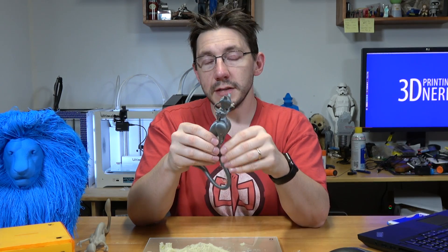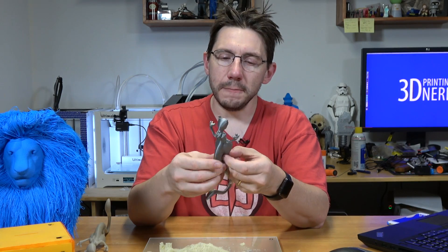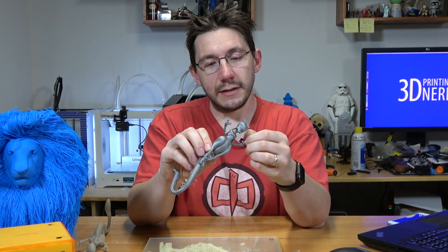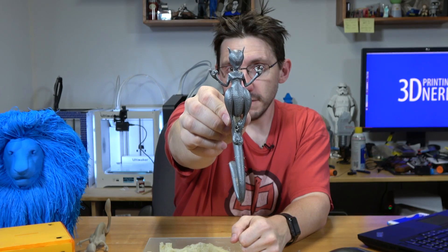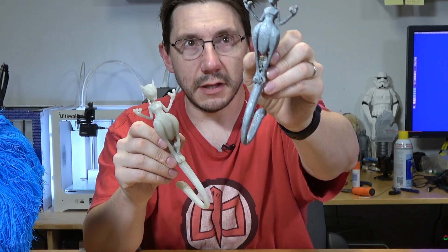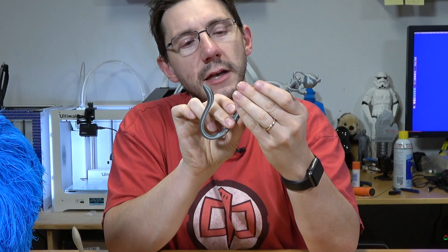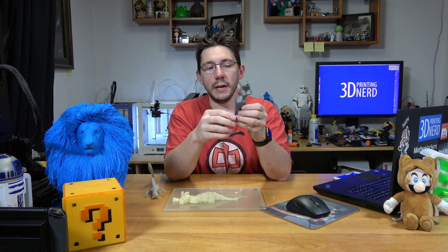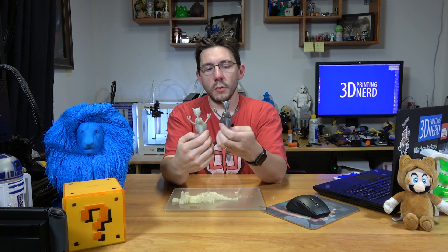Here is the Mewtwo and there are a couple of issues I noticed. The Sigma isn't as much of a push-print-and-get-it sort of printer — I just haven't had everything dialed in perfectly. It looks good, very good. I think the Ultimaker did a better job. This was sliced in Cura 2.4, while the Sigma was sliced in Simplify3D using the Sigma Progen profile. It looks as if there were some issues in Simplify3D resolving where the model intersects, whereas Cura 2.4 had no issues whatsoever.